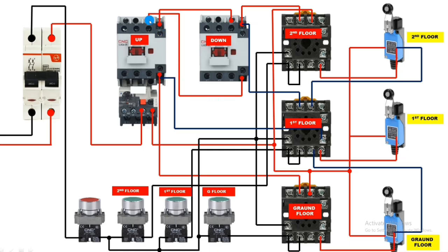Now the contactor line control wiring is done. For operating the contactor, we need to provide neutral power supply — neutral connects directly to up contactor coil A1 and down contactor coil A1. I hope you understand how to do ground plus two floor lift wiring and working. If you have any doubts, please ask in the comments. If you want to watch this video in Hindi, please watch the technical channel. Thanks for watching.